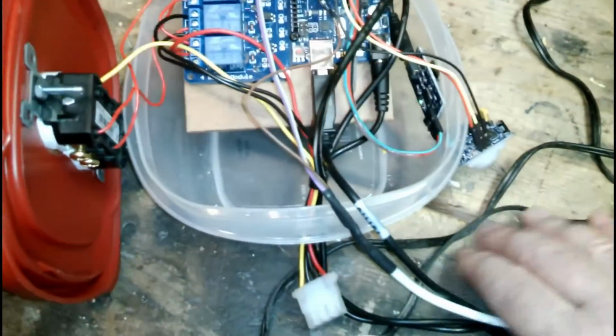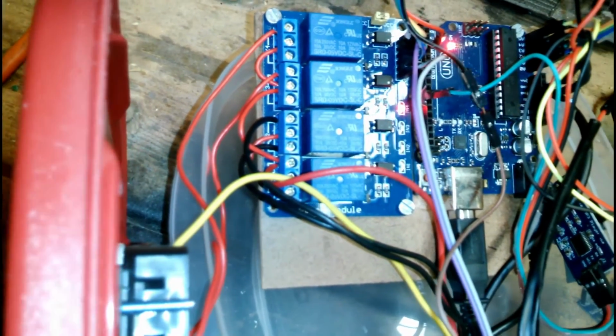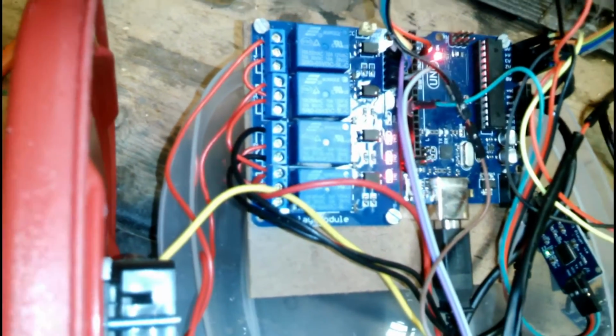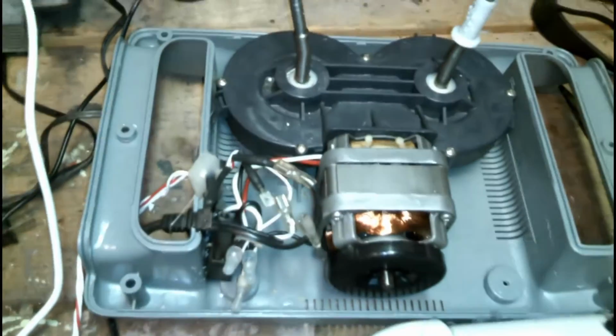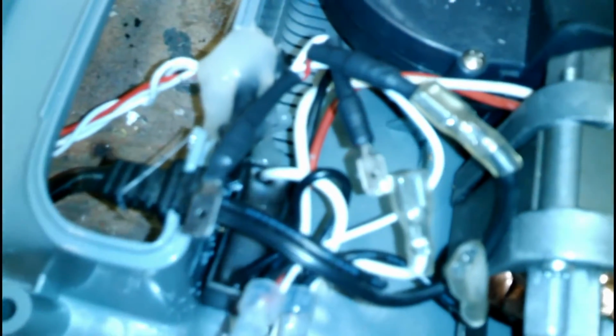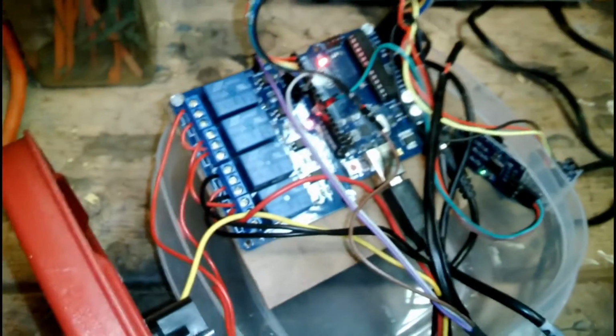I've disconnected the load from the relays. That should work. The stuff works then when there's no load on the relays. Maybe it's the motor or the relay board. I'm trying to lean towards there's something wrong with this shiatsu motor. Took another one, plugged it into the supply here that's supposed to be the beacon, disconnected the leads here so that this shiatsu motor doesn't trigger at all, and now we've got this going off. It's almost the same thing, but now it doesn't crap out on me.